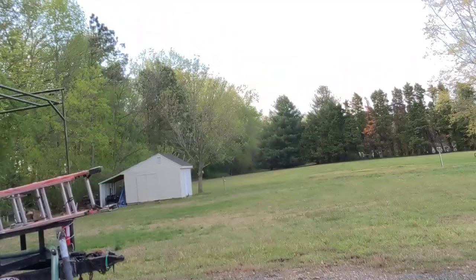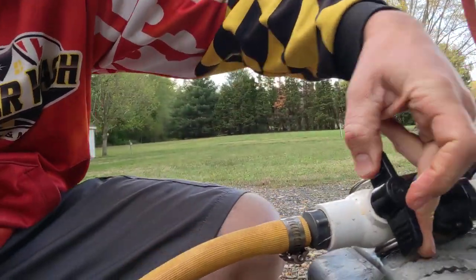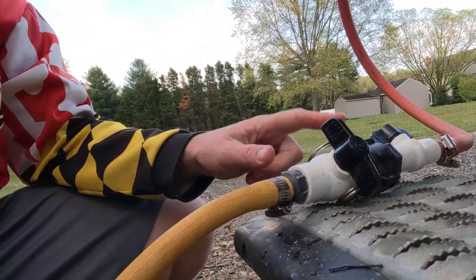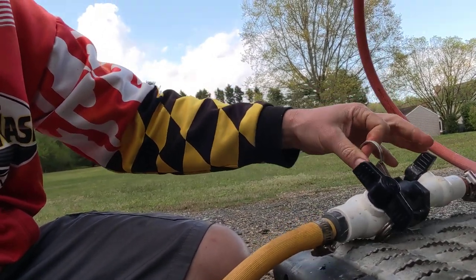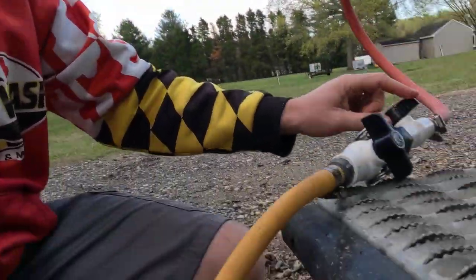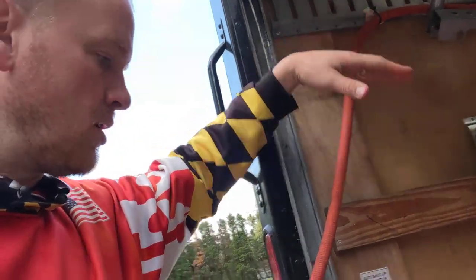Now, the order that we open it up is going to be very important. You have to close off the tank side or the vehicle side. Close off this side so that takes the pressure out. Let's say the orange side is open — we've gone ahead and closed this side because that's going to trap whatever pressure behind it. This side, there's no pressure, so we're going to close that now. You want to look away when you do this, but lift up one side of it and then take the other side off. We don't want to undo both sides at the same time, so if there is some residual bleach in there, it's going to leak out, not explode all over you. When we do take them apart, we want to lean this so that it drains any residual bleach that's in that coupler onto the ground. We don't want to get that on the truck. Then put that up so it's actually hanging up here, not just dangling willy-nilly. That is the bleach pumping system.